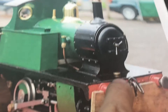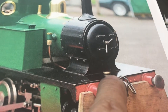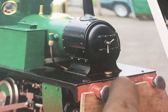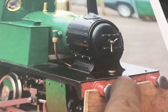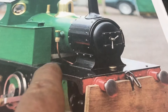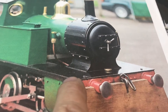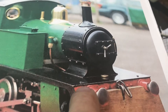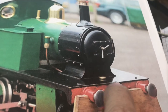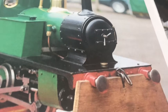One cool thing — the reason I take these pictures is as I got to thinking about reversing the lubricator opening and cutting a notch in the top of the buffer beam, I was worried about whether that would ruin the looks. But looking at this picture, I realized the plate gets laid across the entire frame, so it is not going to mess up that. I can cut away all I need to make a hole in there to make room for the lubricator.